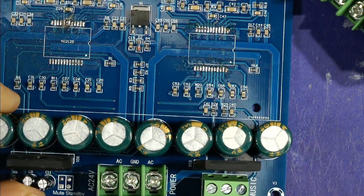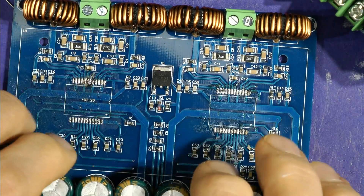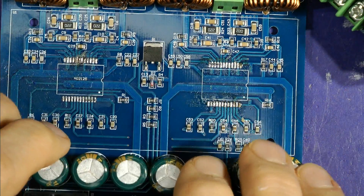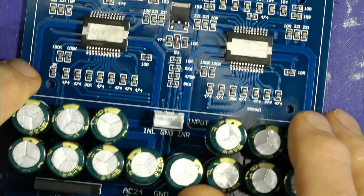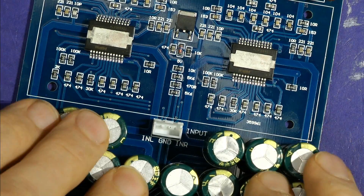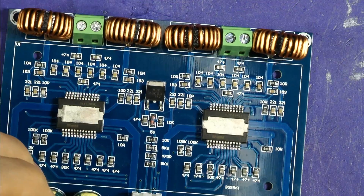At lower power levels — 40 to 50 watts — there's plenty of power for most people and it's actually quite a good module. However, at something like 4 watts it does give a lot of THD — you're talking about a 10% THD amplifier at low levels. When you drive it harder, the signals are much stronger relative to the noise so the total harmonic distortion can actually go down. The datasheet is online — look up the chip and see for yourself.